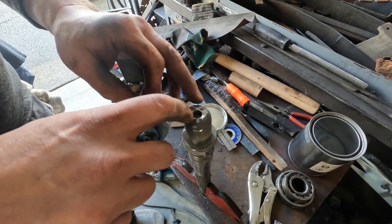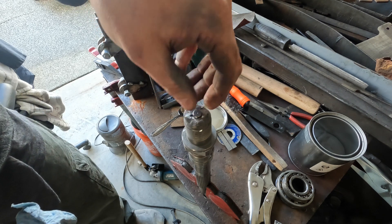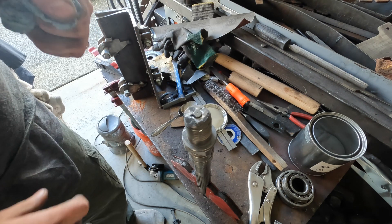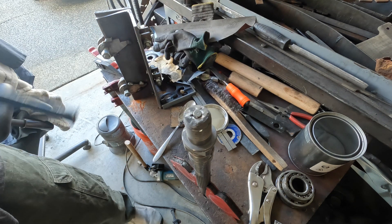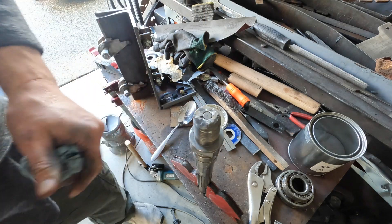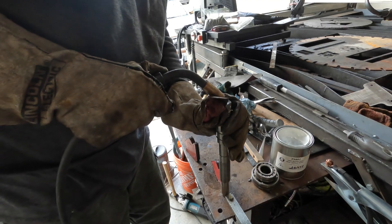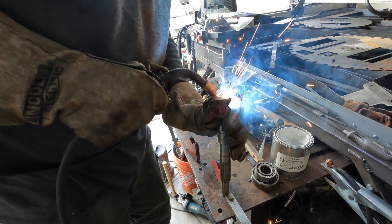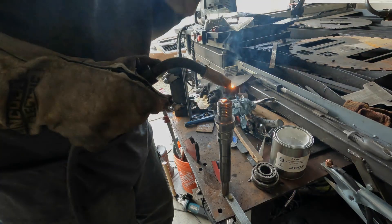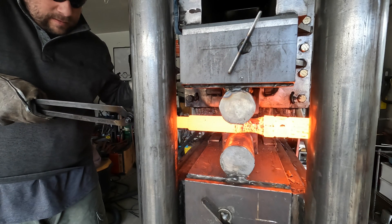These threads were a little problematic - I ended up having to discard the tip once it was drawn out because I had some inclusions and some areas that didn't quite forge because of the threads on the end of the shaft. So I weld the end shut, and that's all sealed up with the pin pressed in place.